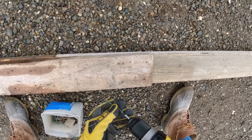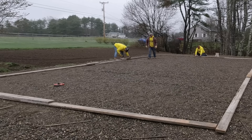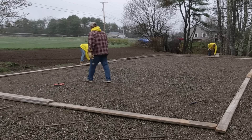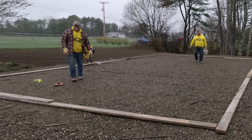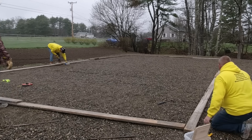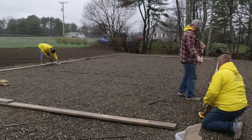Now is it okay to put footings in if you want to? Yeah, sure it is, and we do slabs like that too. But I've done literally hundreds of these types of 6-inch thick slabs for garages over the years and I've never seen one torn out. As long as they're prepped right — if the gravel's done right — you're going to be just fine. As long as the guy doing the slab knows what he's doing, installs it correctly, uses the right concrete mix, pours it at the right slump, uses the right mix design, and knows how to finish it. I've done it for 45 years, so I think that should be some type of proof.